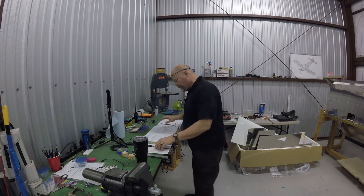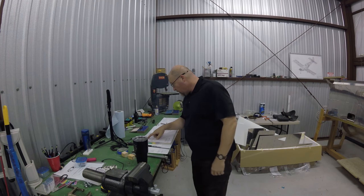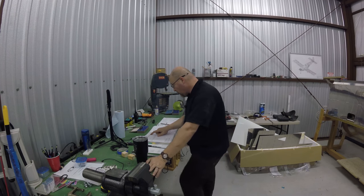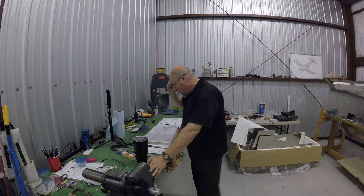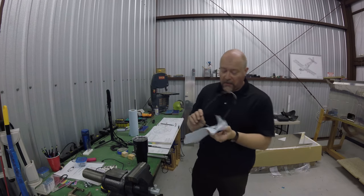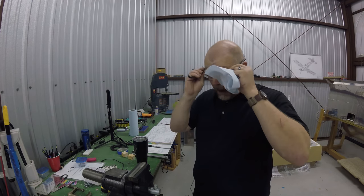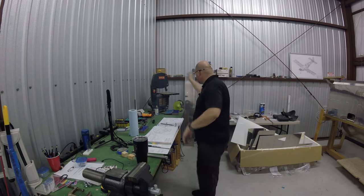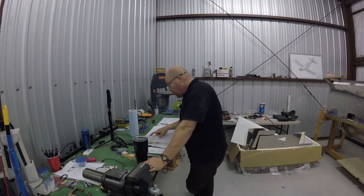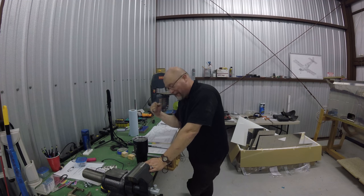So now the back. Ooh, bunch of stuff. All right, let's see. Cleco the clip to the bulkhead side channel as shown in the lower blow-up figure. Mark location for edge bulkhead. Getting sweaty, even though it was kind of cold in here. This manhandling and grunting makes you sweaty. That fogs up your glasses. All right. Remove the clip, bulkhead side channel, using a mark behind the bending line. Blah, blah, blah. Okay, more bending of things. It's endless. Come on, Vans, you could have done some of this for us.